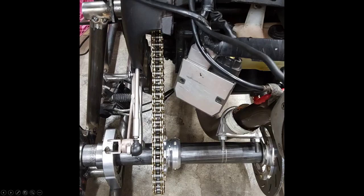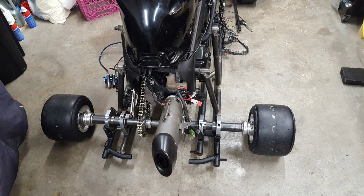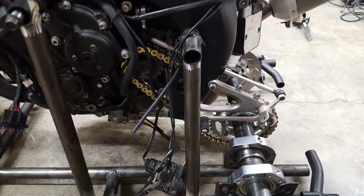I've attached the chain going to the engine right here. The issue is because that sprocket is not concentric — it's a little loose and I can't get it centered just by eye. Whenever the chain goes around and the sprocket is out further it'll pull on the front sprocket, which pulls on the frame, so this entire thing was flexing every rotation of the axle. That was a major issue. Here's a side view — front sprocket up here, rear sprocket there.